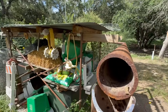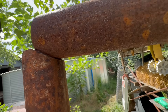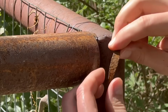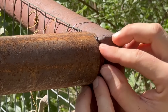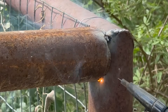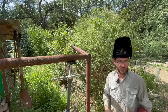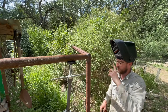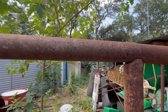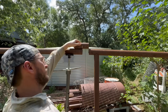You can see here how the saddle joint works — the horizontal pipe just sits in that cut and you can barely even see light around it; it's a pretty nice and tight fit. The other pipe just sits right next to it. Over here the joinery is going to be a little bit different, and I'm going to use some scraps from cutting the pipes to splice in and close the gap — mostly just to keep bugs and water from getting in there. For sections where the pipes didn't quite align perfectly I cut scraps to length and spliced them into the gaps.